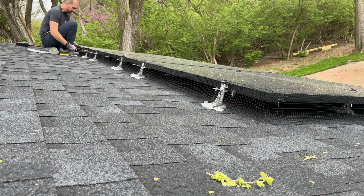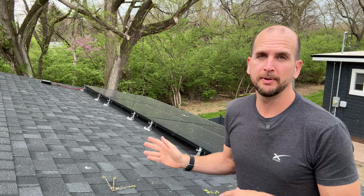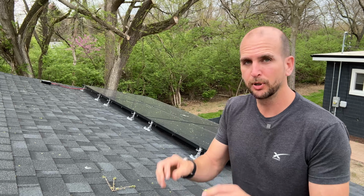So for the mesh on our second option, I'd say from the pro side, the cost, it's much less expensive. It's probably 5 to 7 times less expensive than option number 1. And ease of installation. It goes in pretty fast. You can kind of cut around things very easily with tin snips. So it ended up being quite a bit faster than the first installation per linear foot.